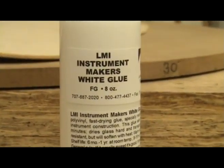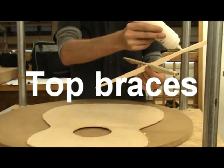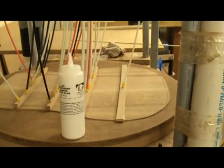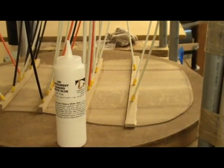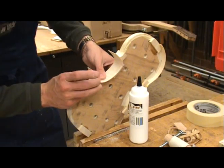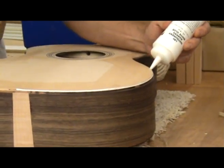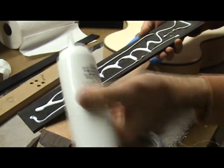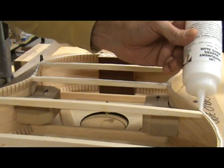A good substitute for yellow glue is the LMI Instrument Maker's Glue. This glue has become an industry standard and is perfect for all steps of instrument making where a wood-to-wood bond is needed. Available exclusively at LMI, it is a polyvinyl glue and the only one on the market specifically formulated for instrument makers. Because this glue dries hard, it is said to provide a better sound transference medium than other glues. It sets up in 15 to 30 minutes, dries transparent, is water resistant, and softens with heat for repairs. The shelf life is 6 months to 1 year, or 9 to 15 months if refrigerated. One way of telling if the glue is still good is to smell it — if it smells sweet, it's ready to use; if it smells sour, discard it or use it for other applications other than instrument building. Another plus is that it dries clear.